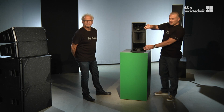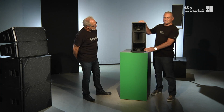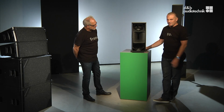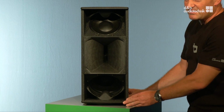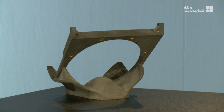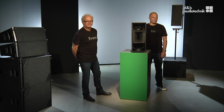In order to achieve the desired low-frequency headroom, we developed highly efficient drivers and optimized many bits and pieces of the acoustic design. The phase plug provides the right shape for the desired mid-range response. The airflow optimized ports are integrated into the phase plug in order to not waste any internal volume. The result of this process is the Klingonian spaceship. All is driven through an internal passive crossover, and two cabinets can be connected to a single amplifier channel.